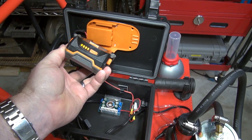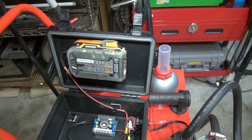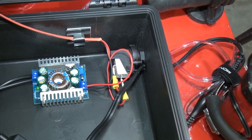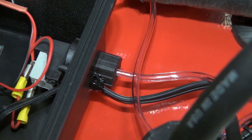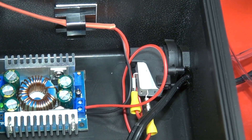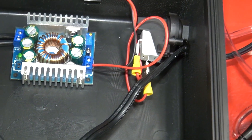And since I don't like being blown up, I needed a way to seal all this up such that any stray gas vapors would be unlikely to find an ignition source. This ruled out a conventional switch that would risk sparking. My solution was to incorporate an air switch as the power function — these are used on hot tubs and garbage disposals to allow power to be toggled in areas where it's unsafe to locate a conventional switch. The push button is really just an air plunger that triggers a switch on the other end of the air tube, located inside an airtight box from Harbor Freight. Inside the box we have a power conversion board, the drill battery mount, a fuse, and the remote controlled switch.